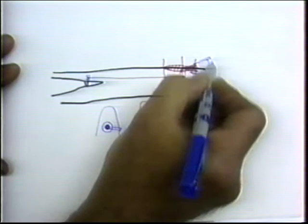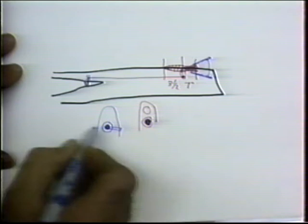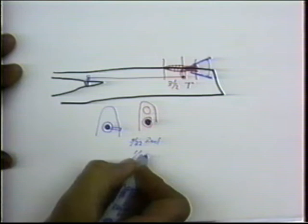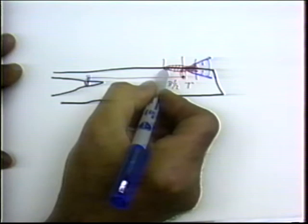So keep in mind, this is all stuff that Big Jim has worked out with Mike and with me and with other people that have gone and done this before. What we're really looking for is the amount of slop that we've come to accept as a traditional amount, and that's a 3/32 rod in an 1/8 inch hole bushing at the flap horn. And what we'd like to have then is have it completely neutral, the same amount up, the same amount down, and the tail set in completely neutral.